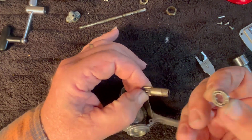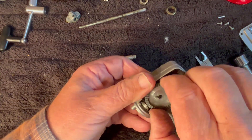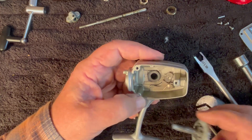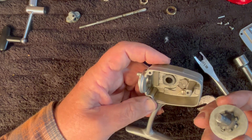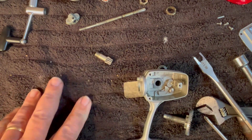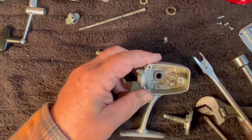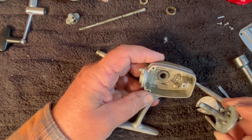That doesn't really feel that bad. Let's push this out and see if there's a bearing behind it. No, it's a bushing — it's built into the housing. So that is a darn shame. Well, I'll tell you what I'm going to try to do on this. I don't know if it's going to work, so before I go spending a whole bunch of time on trying to clean it up, what I'm going to try to do is shim this.